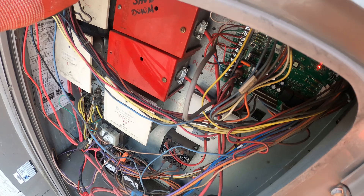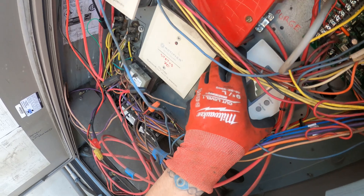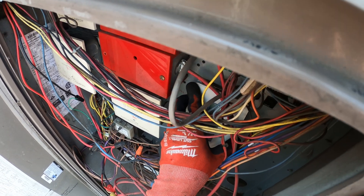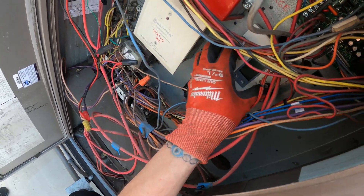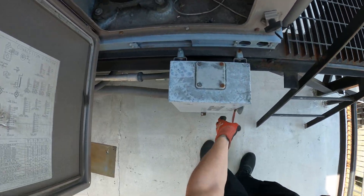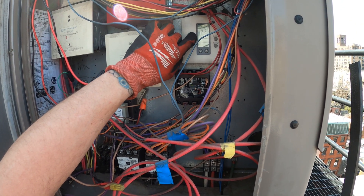This is a little dangerous to do with the power on, so let's turn off the disconnect and see if we can adjust that — hook this thing in. That's definitely better; I think that's in. Turn that back on. Maybe that's why the snowflake kept blinking — possibly the call isn't happening because it wasn't contacting enough.